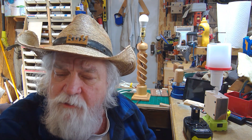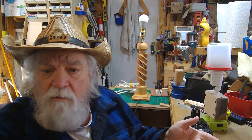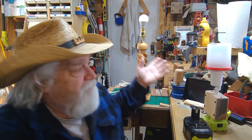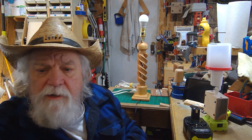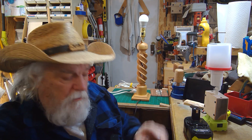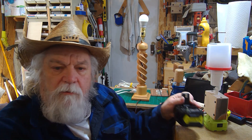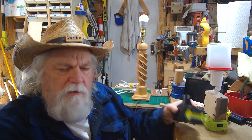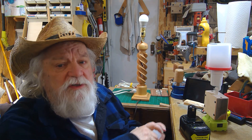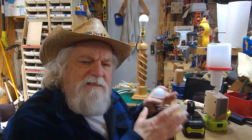But why not — if you've got lamps sitting around your house in different places — use those just as easily? That way you can still turn them on and off like you normally would, only running off of your battery. This battery will run this light bulb for 13 hours. This is a 5 amp hour battery; it has 90 watt hours. This bulb only pulls 7 watts — do the math, that's almost 13 hours. Let's do a quick conversion so you can see what I'm doing.